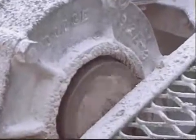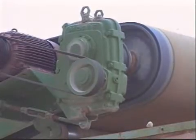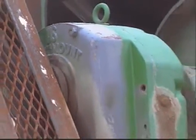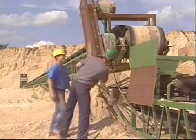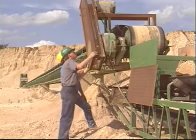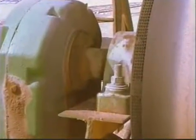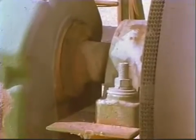Excessive drive belt loads can damage high-speed bearings. Undetected oil leaks can cause gearbox failures. Marginal designs often make for a short working life. Replacement units and parts may not be readily available. But of all shaft-mounted drive problems, none is more likely to generate downtime and inflate repair costs than a fretted, corroded, or frozen shaft connection.